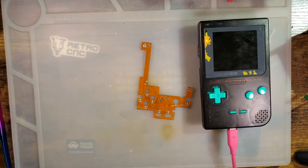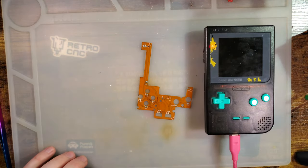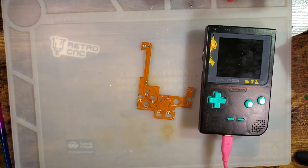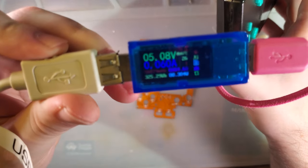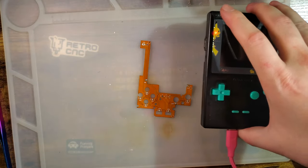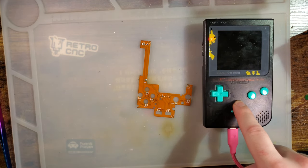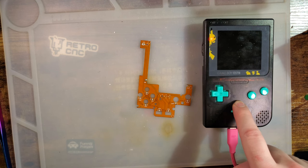Today's donor is going to be this Game Boy Pocket. I have it plugged in and charging because I don't remember the last time I charged it, and I don't know how dead it is. But based off of the current it's pulling, I'm guessing it's basically done charging — it's only pulling 60 milliamps. I think when the battery is nearly depleted it pulls like 500, or even up to 1,000 milliamps, or 1 amp, as the rest of the world likes to call it.